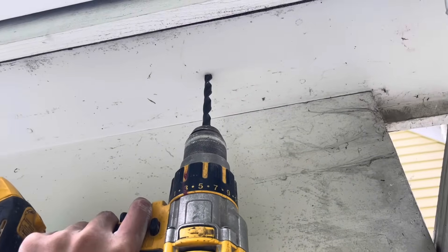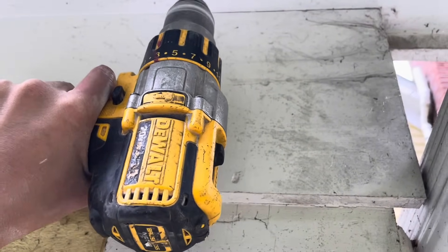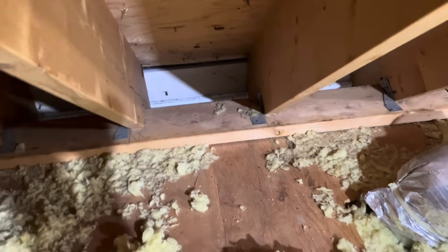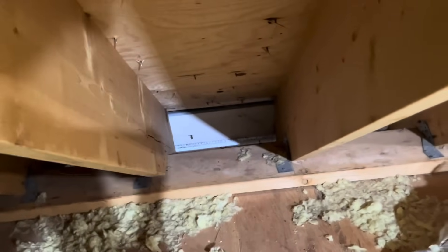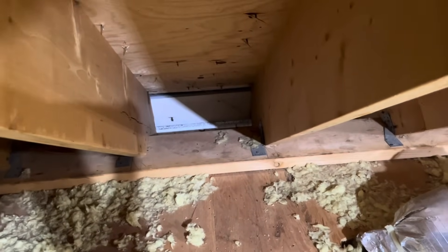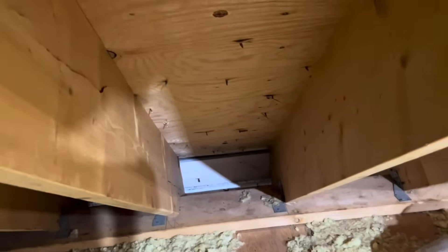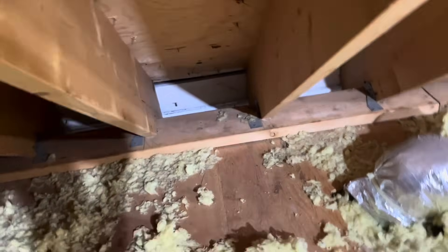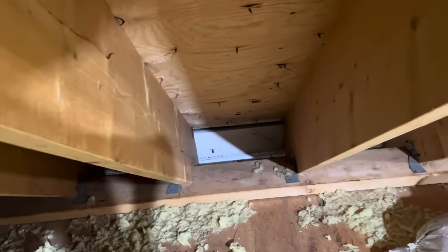I'm on the other side of the soffit now and I'm going to drill a hole — not too big with a spade bit just yet since I might need to patch this. Back in the attic to help visualize: this is the piece of plywood I was complaining about, and there's a piece of wood above it. We've drilled through this layer so there's now a hole, and we have to get the wire to do a U-turn and go into the soffit. It doesn't sound that complicated but it's actually quite hard. I'm starting to think of a Plan B. If I went through the joist I could just mount the beacon on the wall outside, which is easier, but hopefully we can get the soffit location to work.